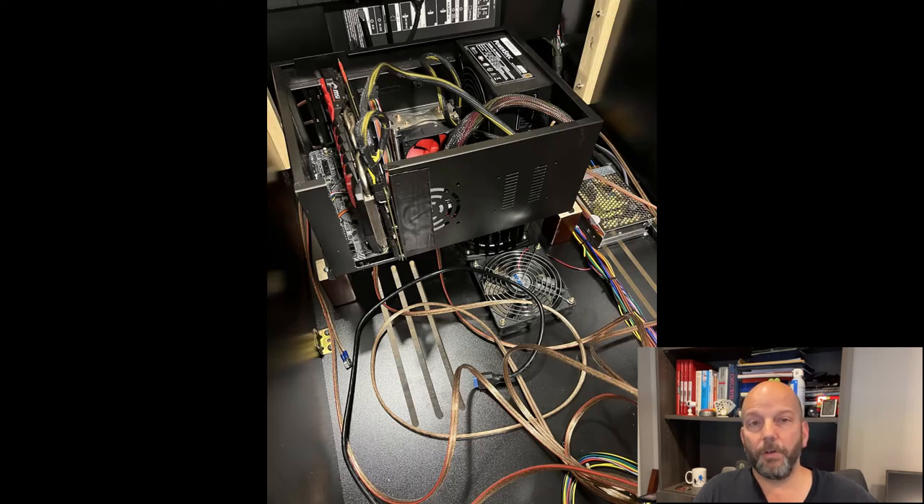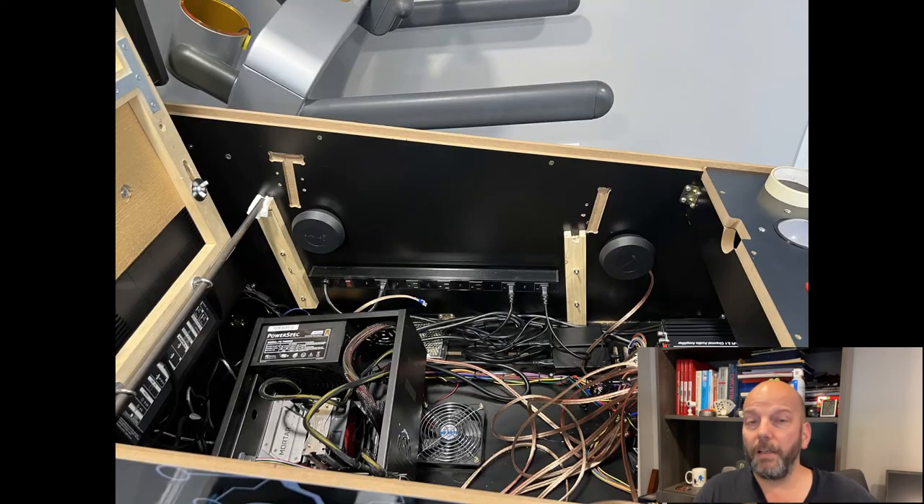The legs are mounted and the computer is reinstalled into the cabinet. You can see that it sits comfortably above the central bass shaker and does not interfere with the playfield display. My exciters finally arrived. I had no choice but to mount these directly into the MDF, so I was very careful to drill a slightly undersized pilot hole and fill it with wood glue before screwing them in. There is no way these are coming back out without damaging the walls.